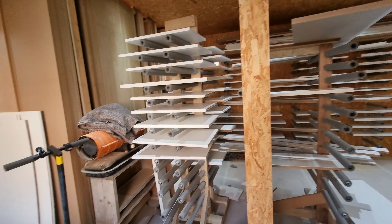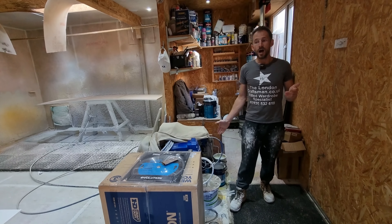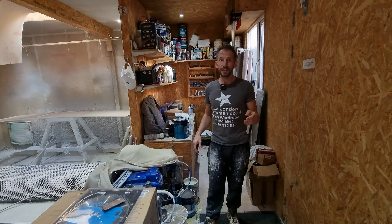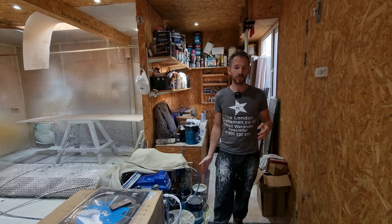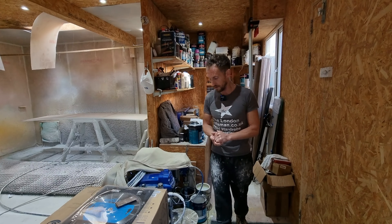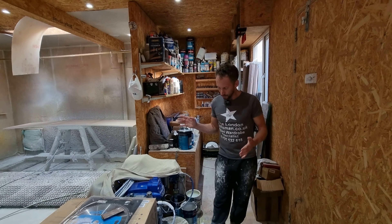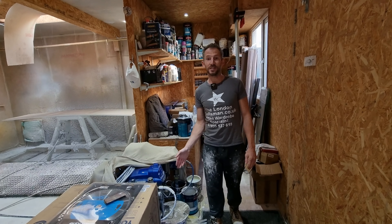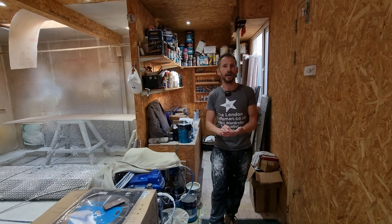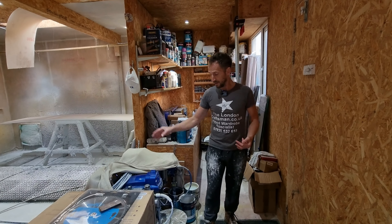Just have a look at all the components that we spray this way — we get amazing finishes all the time. Basically we're spraying one coat, then sand it down with P240, then do two final top coats with no sanding in between, and we get really, really good finishes and it's tougher than you think. I wouldn't advise rolling with my technique, but when I'm spraying it gives a much better finish and it is stupidly tough and durable. I've had no reason to change. When I spray this directly onto MDF it is much better than just a standard primer. When you put this on and try to sand it back, there is no getting it off — it's absolutely solid as a primer.